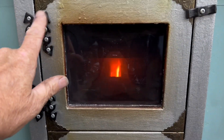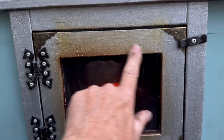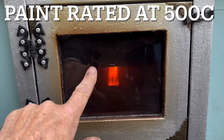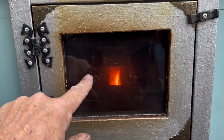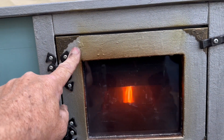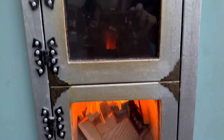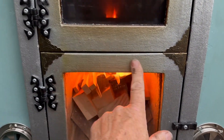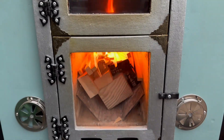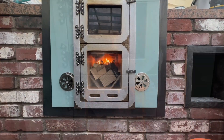I've made these doors out of cement and painted them with a silver high-temperature paint, but this glass is going over 500 degrees centigrade and that heat-proof paint isn't working very well. I'll have to scrape it off and redo it, which is a shame. The lower door is okay, but we're still getting some signs of deterioration there as well.